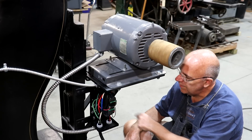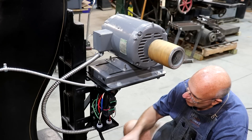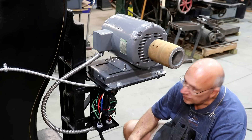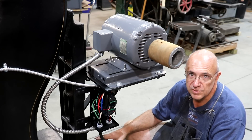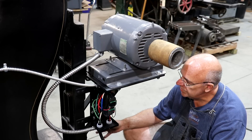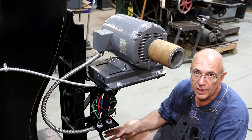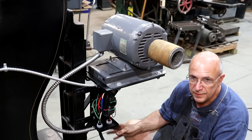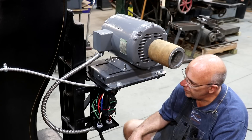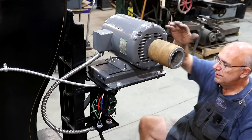It's not going to trip at the breaker — it'll trip right here, and we got this sized exactly for our motor. The power comes out the bottom here and goes to the motor. The other line coming in here is to my remote switch, which we have wired up. If you are curious about how this thing works as far as wiring, I've actually done a video specifically talking about how to wire a motor starter for the remote switch where you have the latch circuit so you can engage and disengage. I'll put a link to that down in the description. But anyway, this is all done — we're ready to button this thing up and let's give it a try.